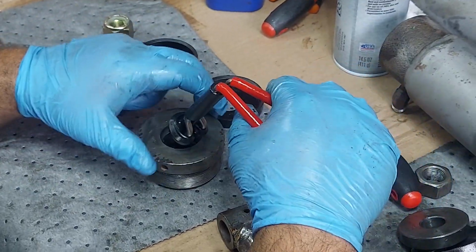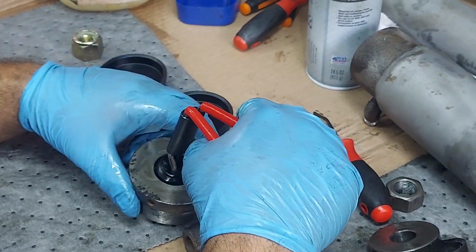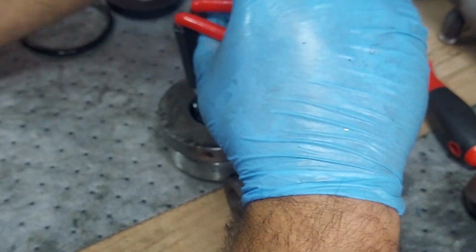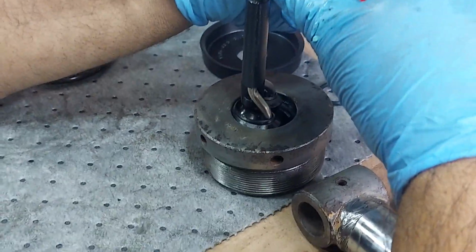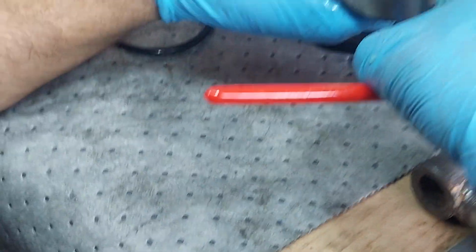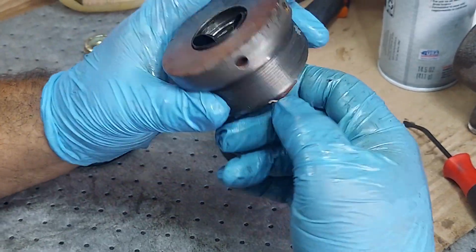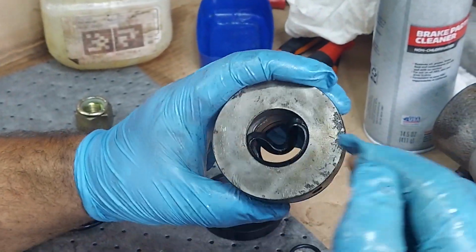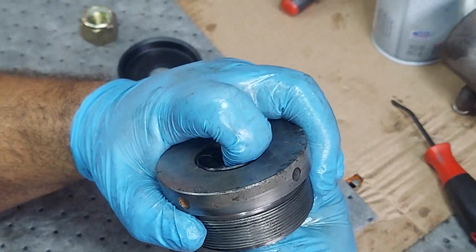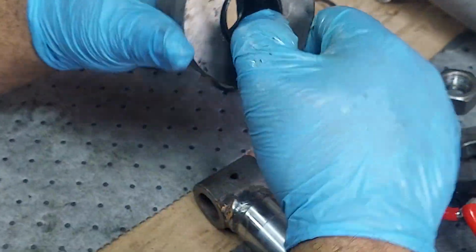That looks like that. This is the direction I want it facing because this is how I want it to end up facing me. And then this is concave and cut at an angle. So is a seal. So that seal is going to sit in there and get it in at that angle a little bit. And then as you open this up, it'll work its way in. And then now that you got it past there, use these outer ones a little bit to set it. And then I like to go in from the bottom because if you're going from the top, sometimes it pushes, and sometimes it will pop out too, but if you go in from the bottom here, you can kind of guide it with both fingers right into that channel. And there it is.